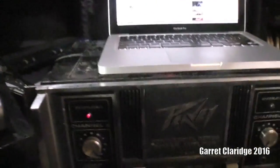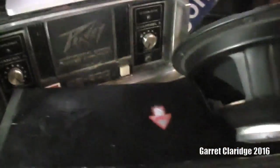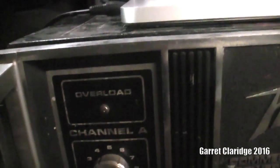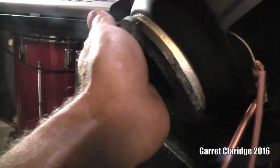Yeah, there must be a lot of bass in there. Look at that overload light. Oh, I can smell it. It's not very loud, but it's eating up the power — it was just running on the peak of this amp. I'll set it just before 800 watts here. When it's flashing, that's the limit of the amp, so we're looking at around 800 watts being pushed into this sucker right now. I can feel the heat coming off it.